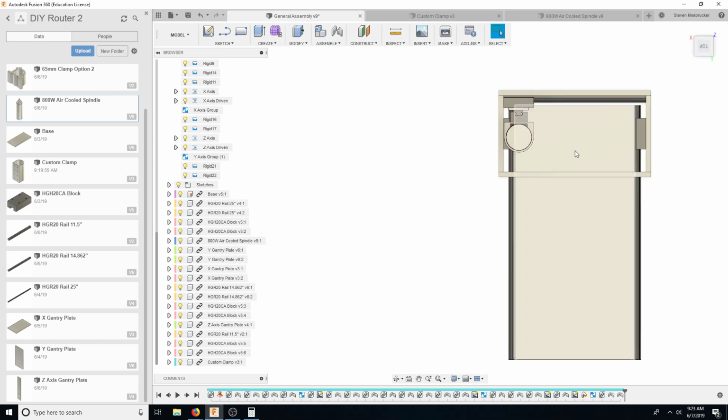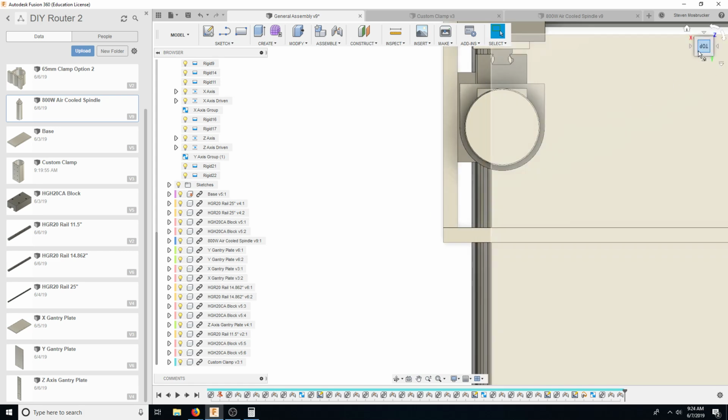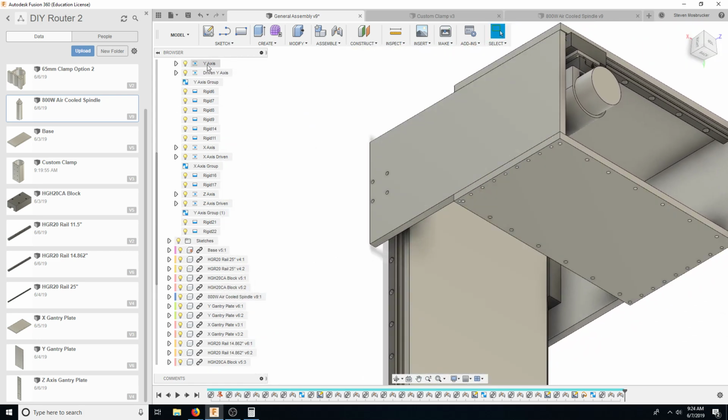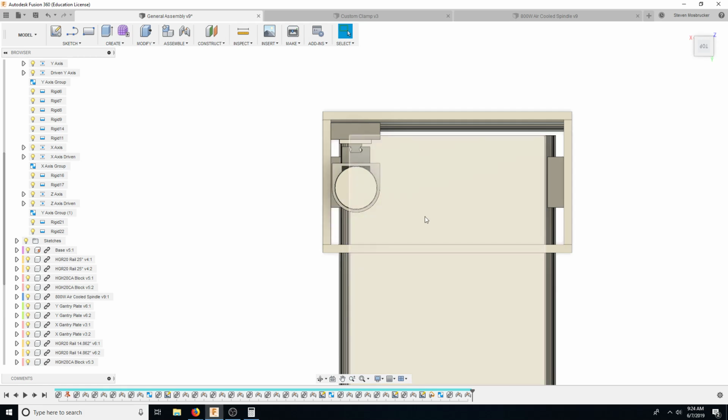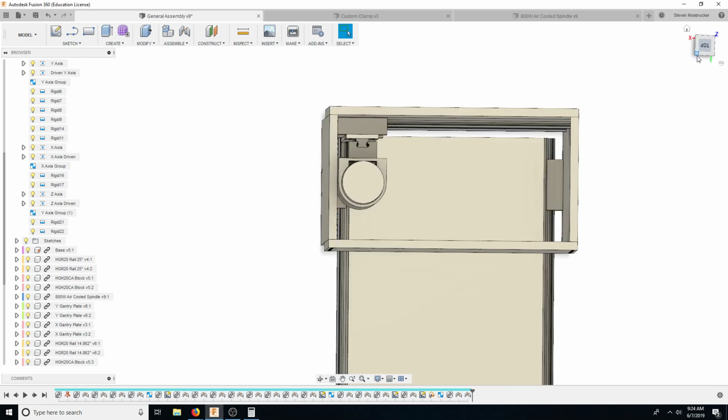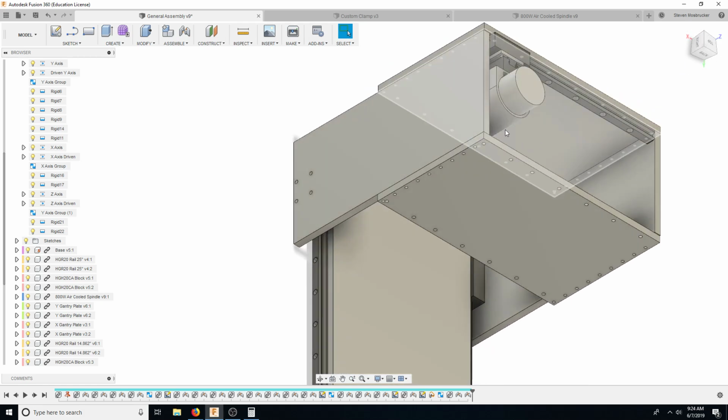that looks really good. I mean, at this point, I would like to do some stress analysis to kind of figure out how this is looking. Because, again, I'm thinking that we're probably not going to go with the rail. We're just going to put a ball screw through here. And then this guy will be supported up with the ball screw. Ooh, but it has to be basically touching this, because it can't be touching that, because that's moving. Unless there's a rail here.